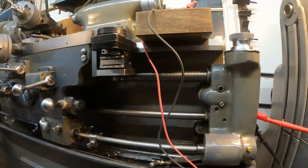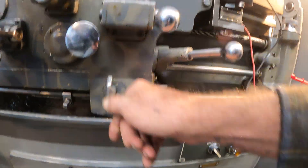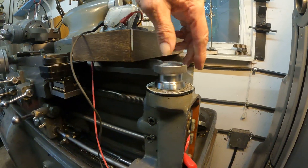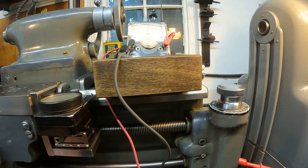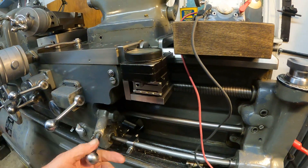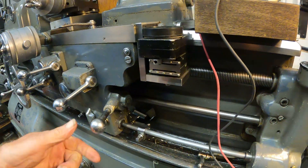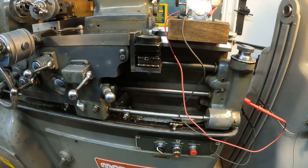It's really quite easy to adjust this — it's a really quite simple mechanism. Now, if you turn the knob to left-hand threads in normal operation, and some people like it that way — to go forward with the spindle, you just lift the lever; that's forward when it's in left-hand. So if you turn it over to right-hand, then forward is moving the spindle lever down. It's a kind of different deal.